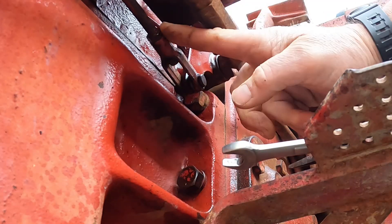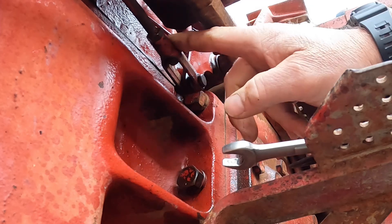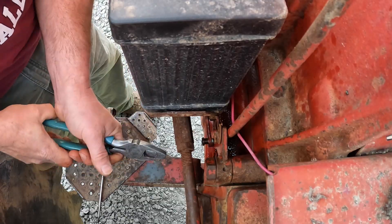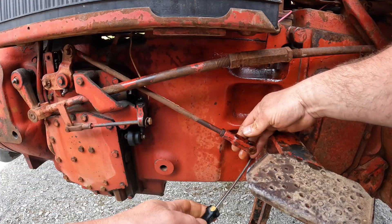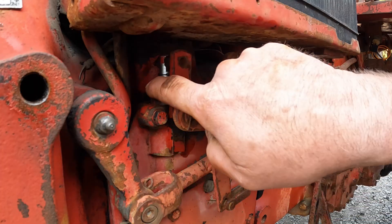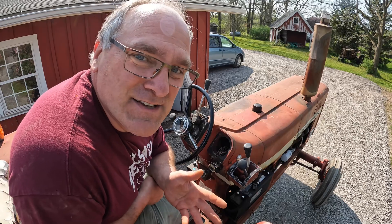To adjust it so the snap ring comes down further, we have to lengthen this linkage rod. On the back side of the rod there's a lock nut and a yoke or clevis that goes onto this plate. So we take this clevis pin out, remove it, and extend this arm. Get that loosened up first, pull that pin out, get the cotter pin off. This rod has a lot of adjustment left — lots of threads — so we'll turn the yoke out and lengthen the rod. I think I've got the right adjustment: turn the lever forward, and that snap ring just about bottoms out on the top of the spool valve.